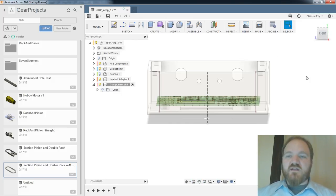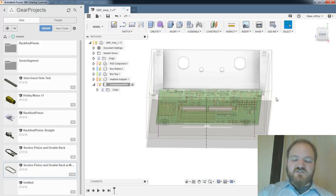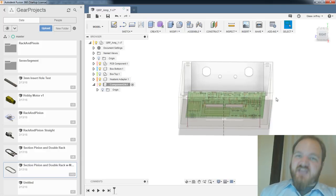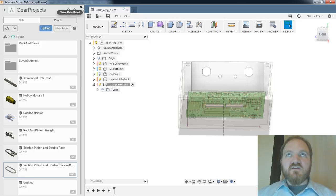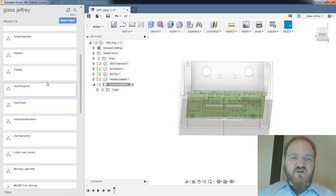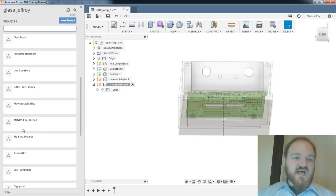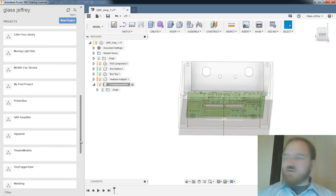And even if you were going to home make one, the actual FETs themselves, your power RF parts, if you're doing a solid state design, are like $130 a piece, and you're probably talking two or four of those for a kilowatt output. There are kilowatt rated RF transistor kilowatt FETs on Mouser for $30 in single unit cost, and I'm sure there's a catch, right? But I can't quite put my finger on what it is. And there are all kinds of design considerations for that much RF power. You need a lot of cooling, like a big copper heat spreader and probably active cooling. Some people do water cooling on top of that. So it's non-trivial still, but I'm just trying to figure out what these parts are, and why do they cost so much less?